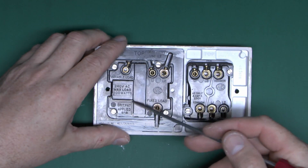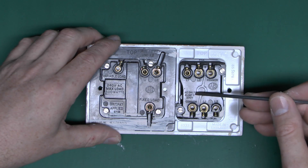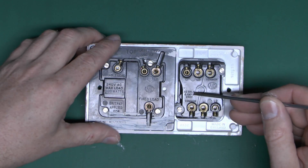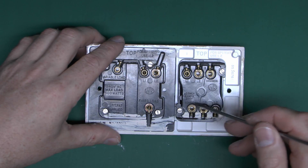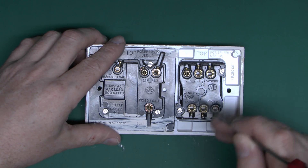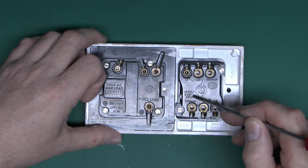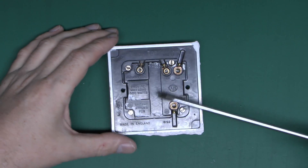This side is the same 500 watts, and these switches over here are actually rated 5 amps — the X indicates they're suitable for use with inductive loads and don't need to be derated. 5-amp switches are fairly uncommon now as they're normally 10 amp, but that was the standard when this was made. It's interesting to note there's a substantial amount of copper or brass on these terminals compared to new ones — they're actually huge, even though this is only rated for 5 amps.